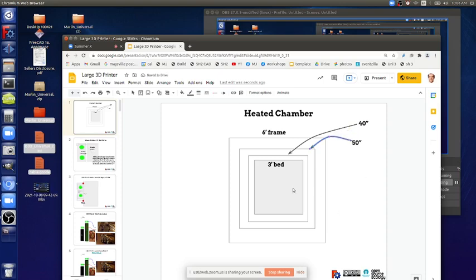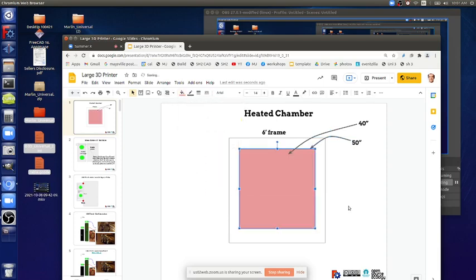So what's practical to do here? Well, to cover the entire 3-foot bed is not possible. And you're just thinking that sheet polycarbonate is fine on top. Its glass transition temperature is 147 C. Yep, so it's not 180. 180 is extreme. That's the ultimate limit when you print PEEK. PEI, the actual print bed surface, you can print that, but you need a 180C heated chamber. So we're not going to do that.